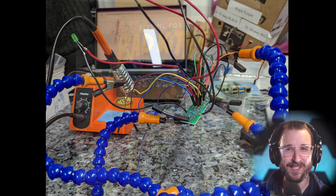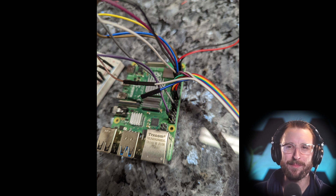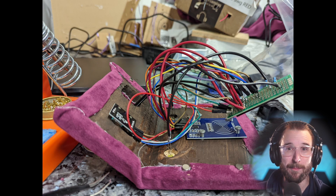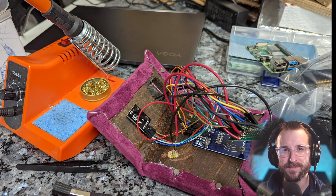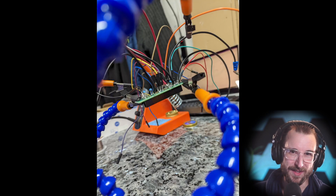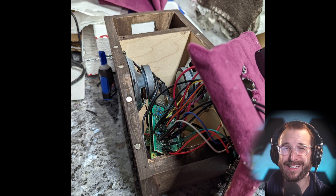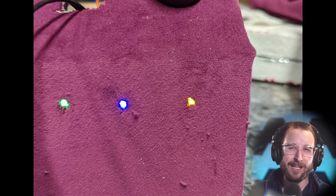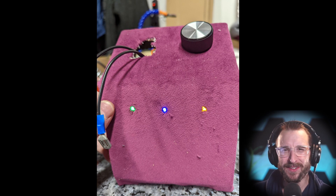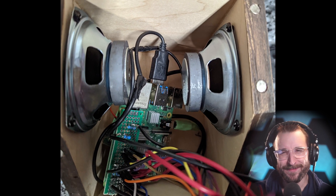I'll conclude with lessons learned. On the positive side, using the Raspberry Pi was very efficient in terms of development time, with many Python libraries available. Being able to access the box over Wi-Fi was also a good idea. Having the cover open with magnets is a clean design choice, avoiding visible hinges, though the magnets are not very strong. On the negative side, the box is too small — the Raspberry Pi is literally touching the speaker magnet, which is not good long term. The whole microcontroller section is very tight, making it harder to resolder wires if something goes wrong.